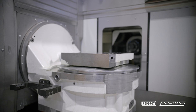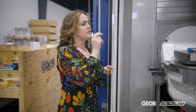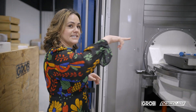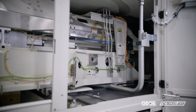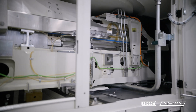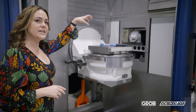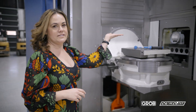One of the things that makes our machine so rigid is the fact that we've got three bearings that follow your Z right here, where that spindle is all the way back and then brings it as that spindle face comes to your part. That's when it's the most rigid, so you've got three of those bearings holding that stiffness.